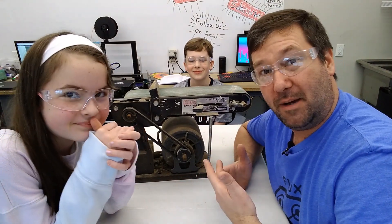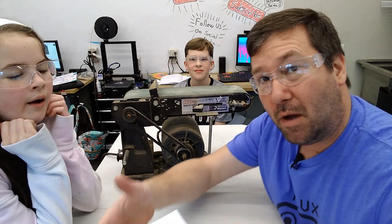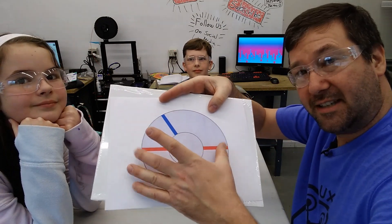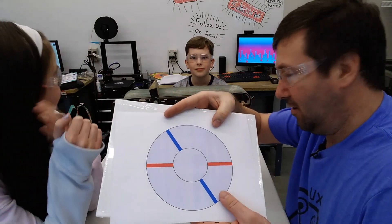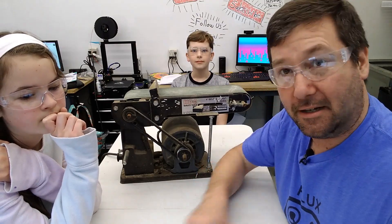But what we're going to do is take it apart and talk about what is probably wrong with this. Most single-phase motors, if you remember from our motor video — which I'll put a link to in the description — they have their primary pole, which is where you connect 110 in this case, or it could be 220 single phase. And then they have this other pole that connects to the capacitor. Now I don't see a capacitor on the outside of this, so this may not actually have one. But we're going to take it apart and find out and see what the inside of it looks like.